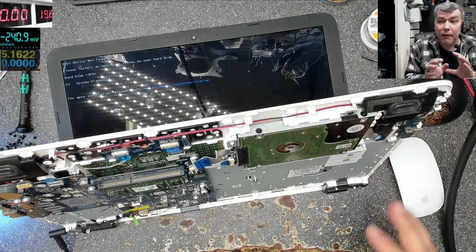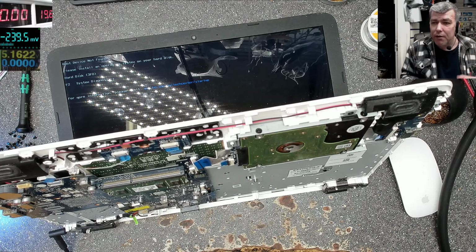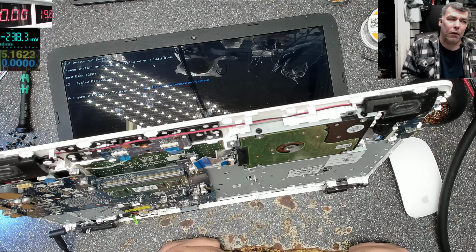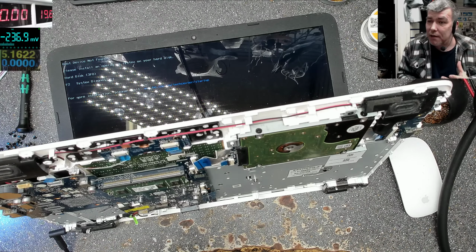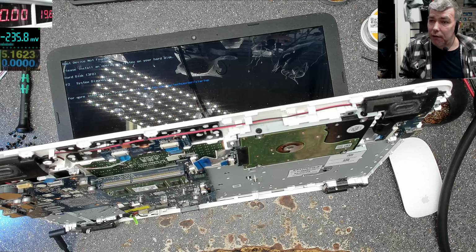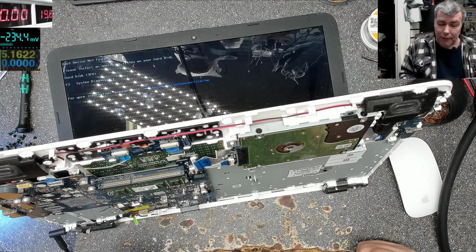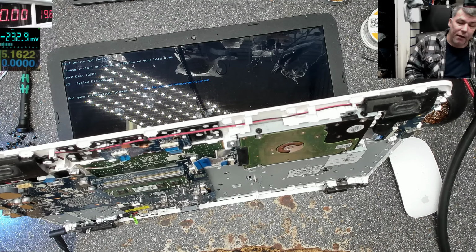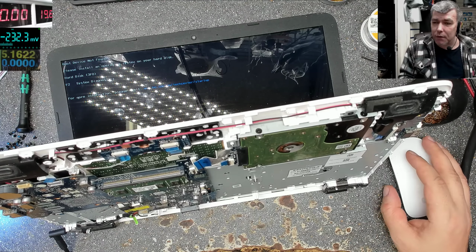I'll stop now. I just gave you an idea, take this as an informational video. Don't think you have to do it the same way. Just take the information out. This is how we can diagnose a dead machine, the steps. If I did it a different way, let's say the current is not passing that MOSFET, let's check why. You start checking and checking and checking, and at some point, let's say you fix it, and oh, my CPU is dead or my Super I/O is dead, and you spend time for nothing. That's why I'm trying to bring the main power rail up to see if everything is working. And if everything is working, only if you want, you can start checking exactly what's going on and why that MOSFET is not carrying the power.